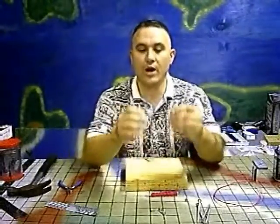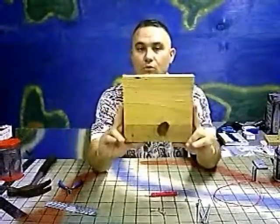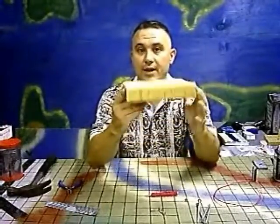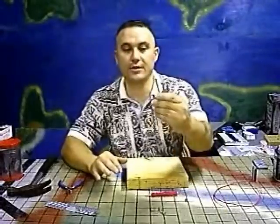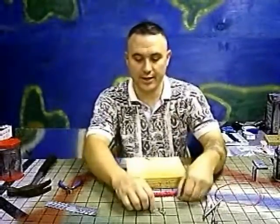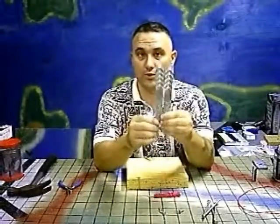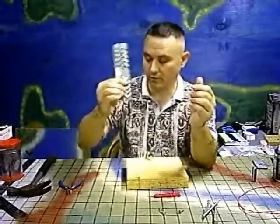In this section we'll be taking our basic theory of wrapping the wire around the nail to create an electromagnet and expanding on that to create a telegraph. Items we're going to need are a block of wood — this is an 8-inch by 8-inch block — some nails and some smaller nails, the solid core wire to create our coil, and our magnetic strips of metal.